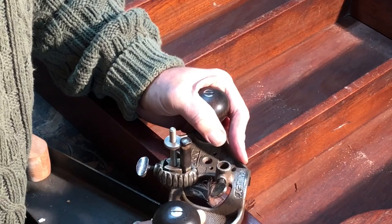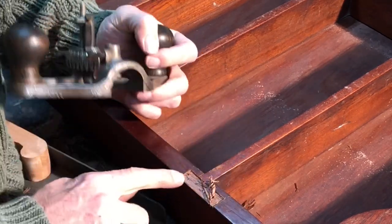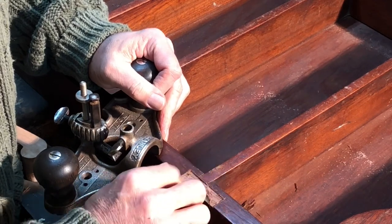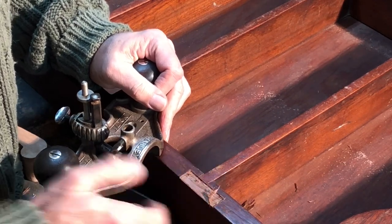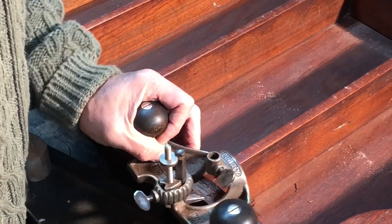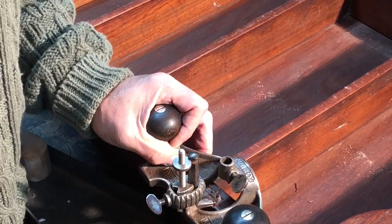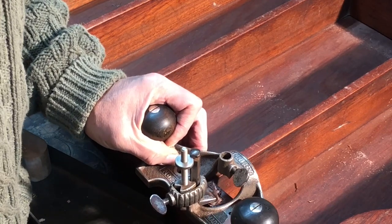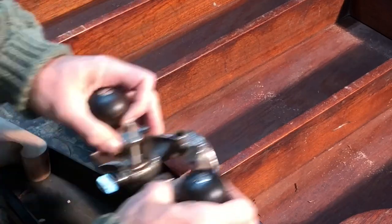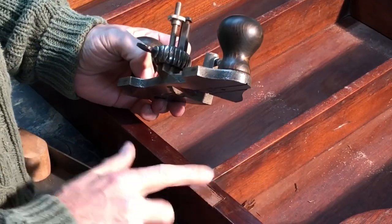I'll pull up so you can see that better, I think. But you see, by doing it this way, I'm coming in here and I'm just planing off that surface. You can feel how smooth that's getting in there. But so this will be my finish cut. And see, what I do is I come in and I slice with it. So it's not just a matter of going straight in, or I might hit something or break it.